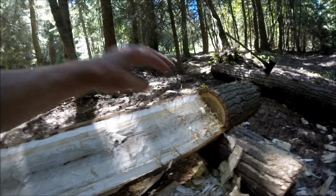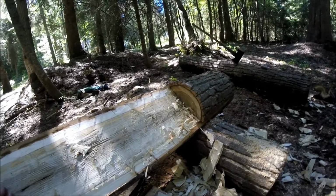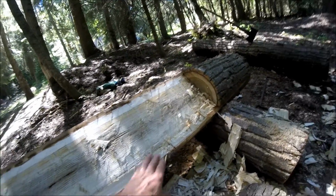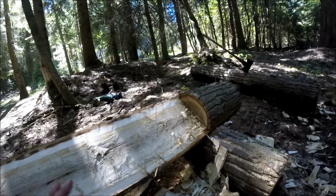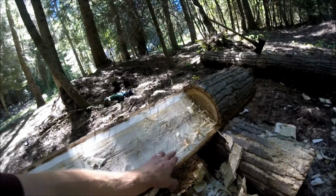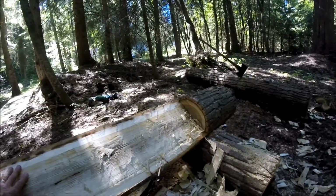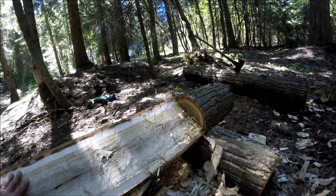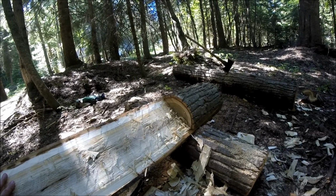The log was crooked and it was real cut off a lot out here, back here in the middle, real big thick blocks. Then out here, as it got thinner, because of the curve of the log, it was starting to dig in, and I was getting below the saw mark here. So when I get done with this log, I'm going to roll it over the other way and come back against this, because this was catching in and it was going deeper and deeper, which isn't a big deal when you're talking about a log for the log cabin. So I'll show you how I'm going to avoid that on those last 2 chunks.